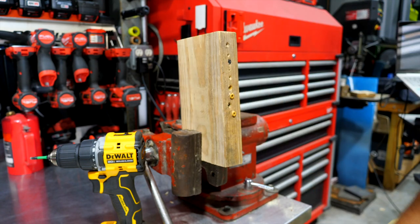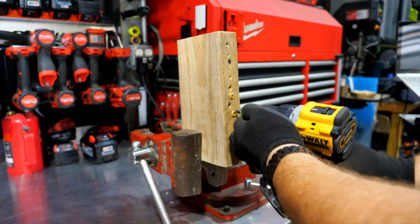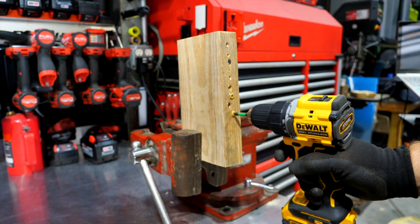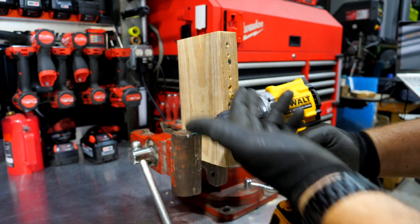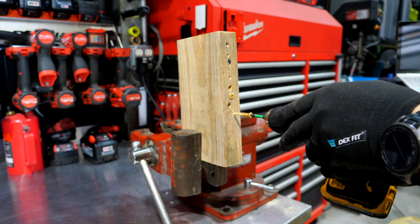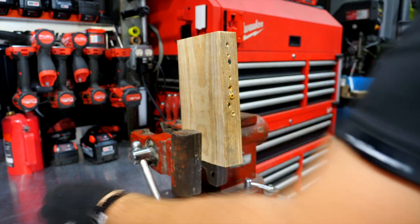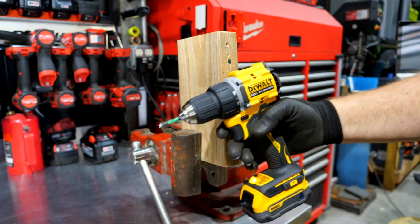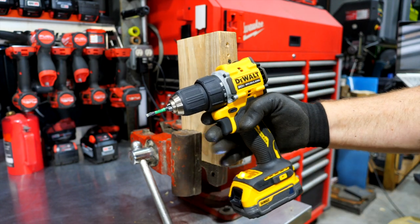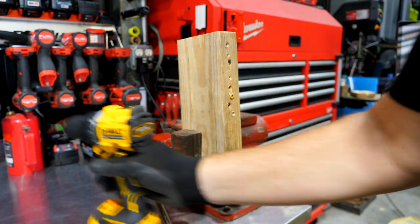Smaller screws, absolutely. Drywall screws, things like that, going to work fine for doing that. And I don't know that I would count that as a negative, just letting you know that using that clutch, if that's what you're wanting to do, probably not going to work out in driving these larger ones. Now, if you're driving self-tapping screws into sheet metal, galv roofing, something like that, absolutely, that clutch is going to work out just fine for you.